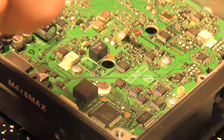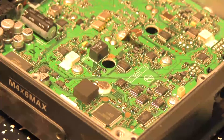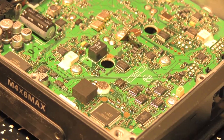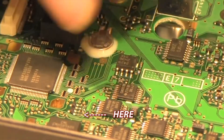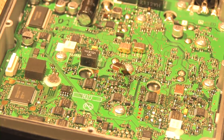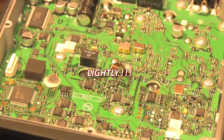There it goes. It's stuck to the bottom of the solder wick — I know you're not going to be able to see this, but I swear this thing is just tiny. But that's all there is to it. The only thing you want to make sure of — if you have a nice magnifying glass — is to examine the two posts between the component that you just removed, just to make sure they're free of any conductivity, meaning any loose solder or a stray piece of whatever. Maybe just scrape it from side to side with something small. And that's it.